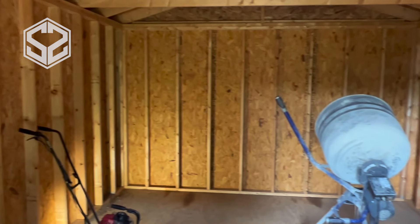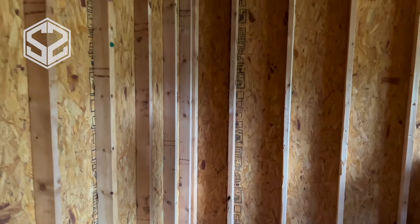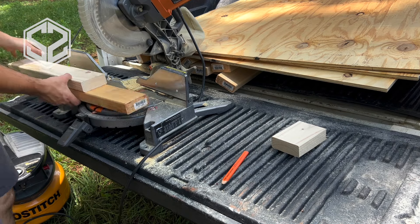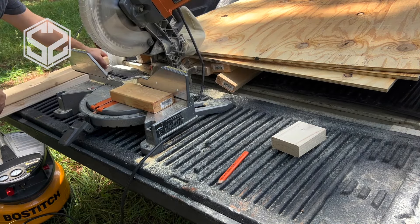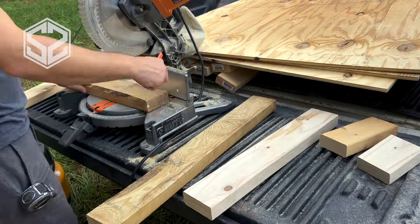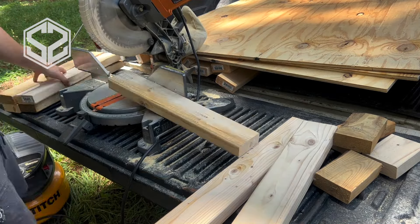Here's the space that I have. Right now the shed doesn't have anything in it, just floor space, and it's not as usable for me without some storage shelves. So I'm going to be building this along the back wall. The shed is 12 feet wide, so it's a 12-foot section and I'm going to be doing it two feet deep. This is perfect because I can easily rip down a piece of plywood in half and use both halves perfectly on the shelving without any waste.